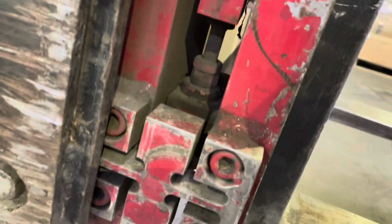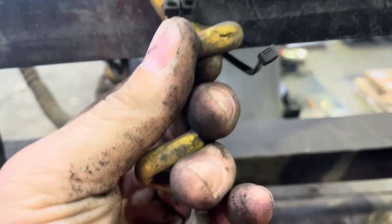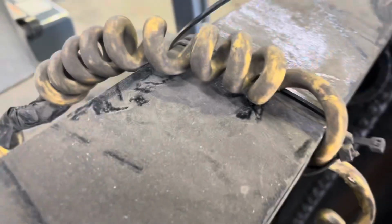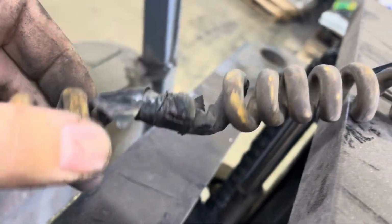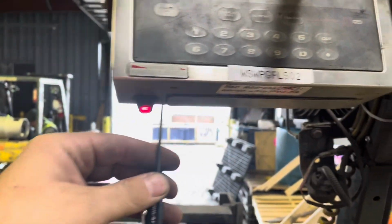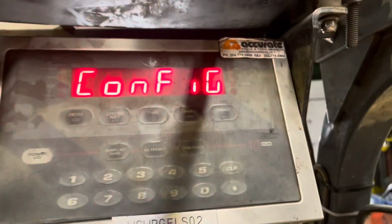And again, I'm checking everything over one more time to make sure that there is no damage, that I didn't miss anything, and I don't find anything. But on this part, when I was rechecking the indicator wire, I found additional damage, some cuts, rips, or tears. I'm like, okay. And then I saw this. I'm like, oh, this could be the problem. I tried to look and see what was going on, and I didn't find any issues with that. I moved it around. It didn't fluctuate the readings at all.